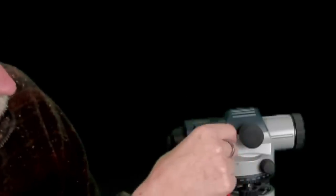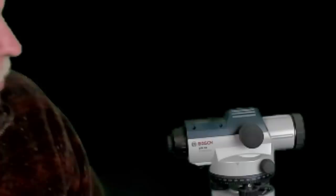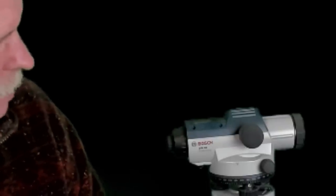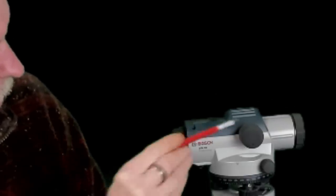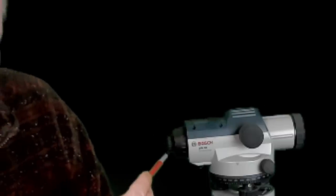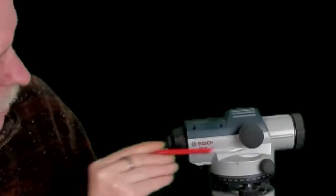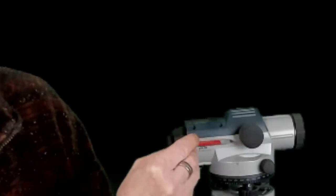As a final check, inside there's a small pendulum or plumb bob that hangs straight down along the line of gravity. The telescope's optical train is set 90 degrees to that vertical, and as a result, once this is set up and calibrated, when you look through the telescope and look at an object in the crosshairs in the distance, whatever those crosshairs are on will be exactly horizontal to this point right here at the auto level.